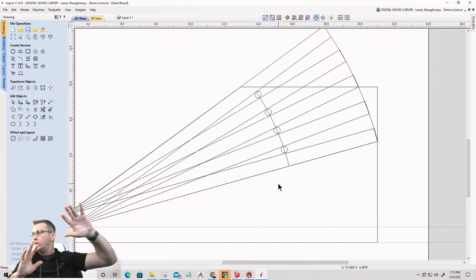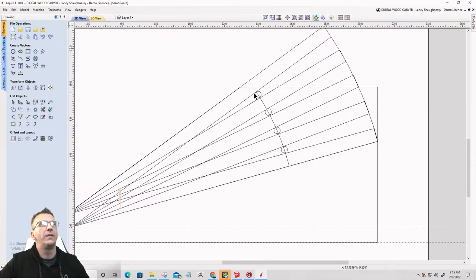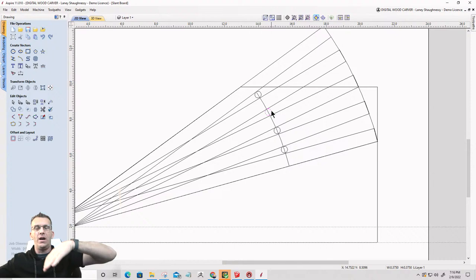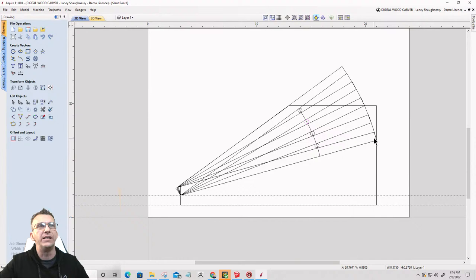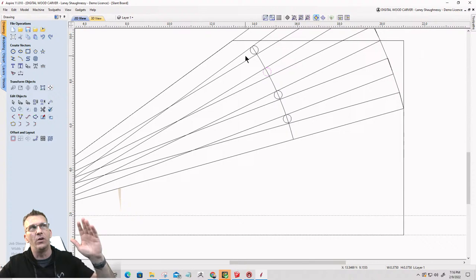Basically, looking at a side view, in its resting state it's going to be at 15 degrees, and then it's going to be able to increment every five degrees. I've got a three-eighths inch threaded metal rod that is going to be able to slide through for the different heights to adjust. I'm going to make some wooden star knobs — one's going to be fixed — but it's going to be fine for me to unscrew that, pull the rod out, and change the adjustment height. So from 15 to 20 to 25, 30, to 35 ultimately.